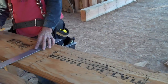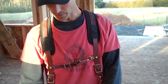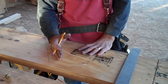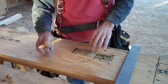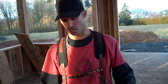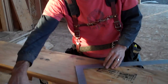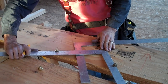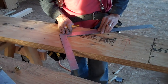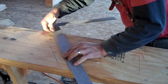From this end of the stringer, I want to put a ledger against the landing that I'm going to nail all my stringers to. It's going to be a two-by material, so I need to minus an inch and a half off the end of the top of the stringer, or else my rise on the top stair will be too long. The square is an inch and a half thickness on its short leg, so I'll just line that up, mark the inside, and continue that.